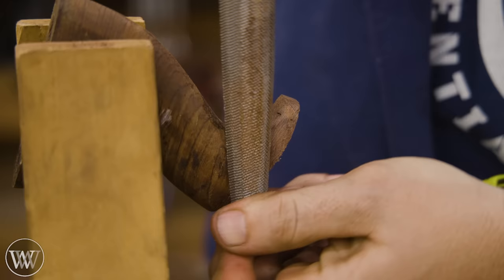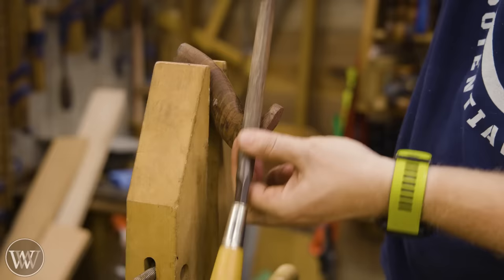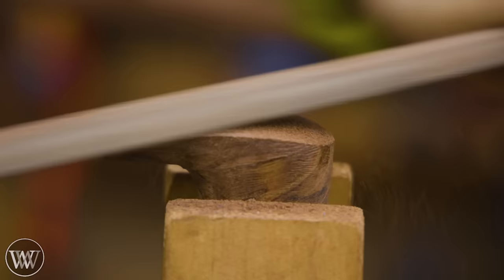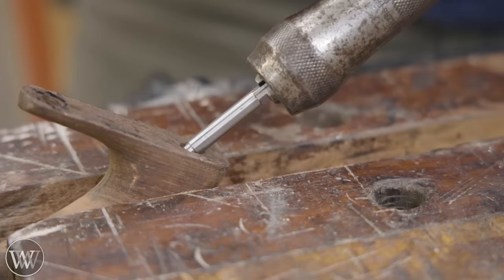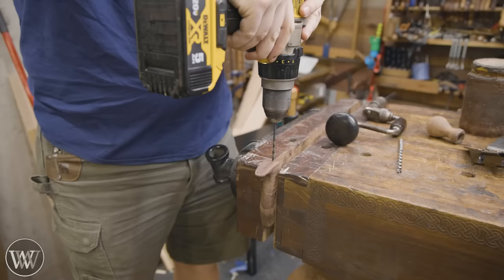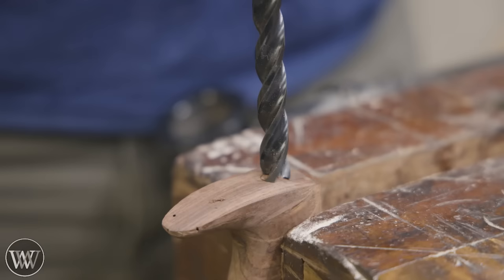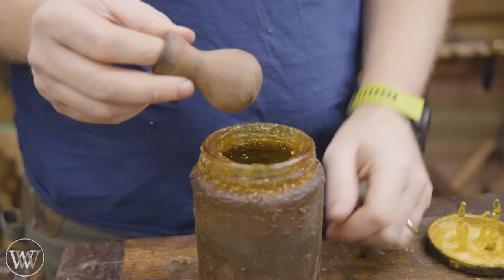You can still see the seam and it will show up even more when finish comes on, but as of right now it's actually really close. I'm going to stop and feel it as I go and make sure everything is close to what I want. I'll come back with a quarter-inch bit — the main shaft going all the way through — and go until the tip just barely touches out, then turn it around and put in an eighth-inch hole. This will allow me to put in the large auger bit, because we need a large hole on this side for the brass fitting to go in and fit down into. Use a gouge to clear anything out, and now we have down to the old seat where the brass fitting will fit.